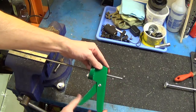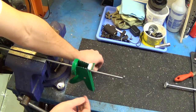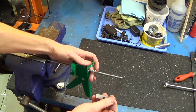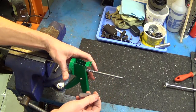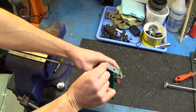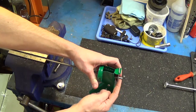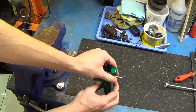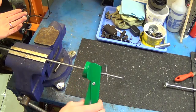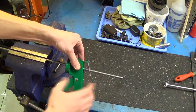Now the ratcheting handle has tension on it — that's what we're looking for. Take the next spring, the small one, slip it over the end and hold your finger on it so it doesn't go flying off. Take the larger outer plate and stick it through — put the rod through the end of it, push it toward the housing, and move it forward. Now the ratcheting mechanism works correctly: it will move one way freely but not the other.